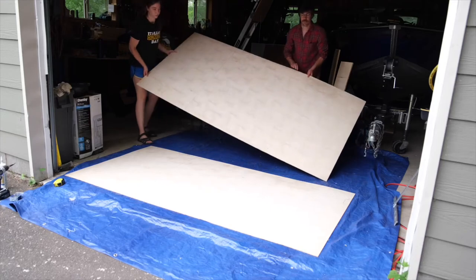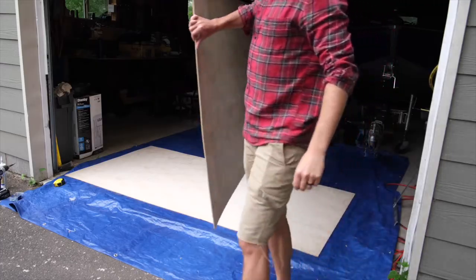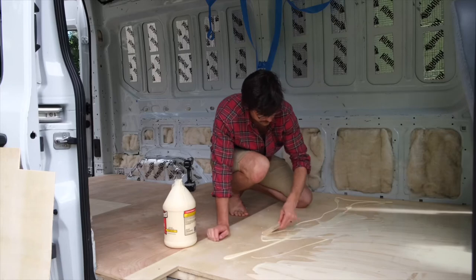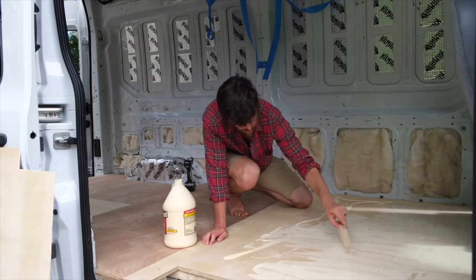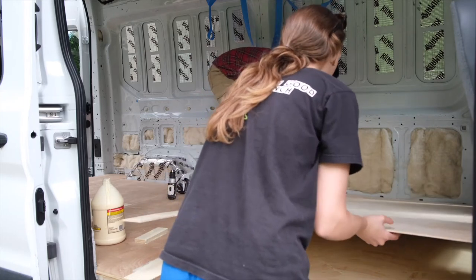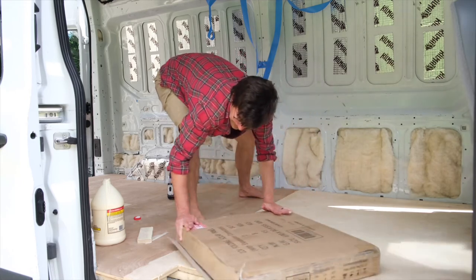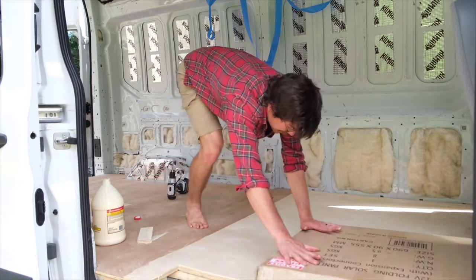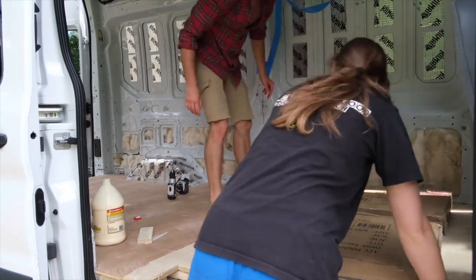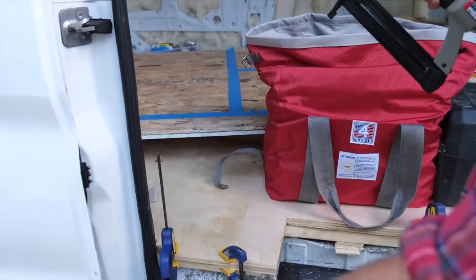This brings us back to why we would have preferred to glue our subfloor plywood in place rather than screw it, because we had to think of a way to cover all those screw heads that would have been visible through the marmoleum. Our solution was to cut and glue a layer of quarter-inch plywood on top of the three-quarter inch ply — a pain, but it did the trick. Hindsight 2020, right? We used heavy objects to press the quarter-inch plywood firmly onto the glue, then, just to make sure it stayed down, we used a nail gun all along the perimeter.